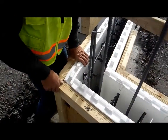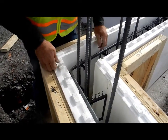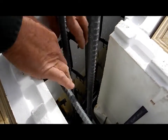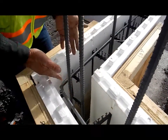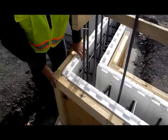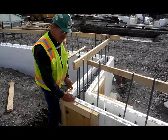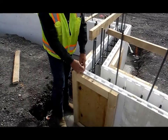As I mentioned earlier, when we go into these non-90-degree corners, we end up having to cut these ties out. You can see right here we probably have 12 to 16 inches of formwork that doesn't have any tie and is unsupported. As I mentioned on phase one, we actually put a brace here and a brace here — they were the 10 to 12-foot braces — but we ended up with a little bulge in this area.